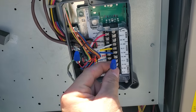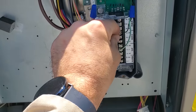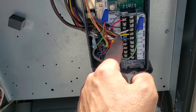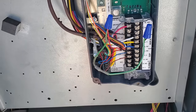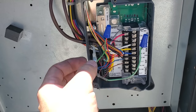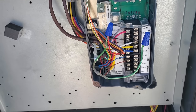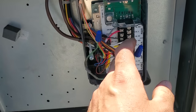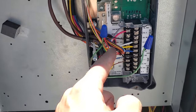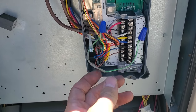Last step: I need to hook up the fire alarm. I disconnected it during testing just because I didn't want to set it off. The fire alarm is simply a contact with a resistor — this is an end-of-line resistor. This just proves the circuit, so I'm trying to make sense of this. It tells the alarm company they have a good set of wires. If they get a direct short across the wires it says there's a fire; if this resistor disappears it signals a trouble condition — meaning a wire may have been severed — warning them that a fire alarm condition might not come through because there's a problem with the circuit.